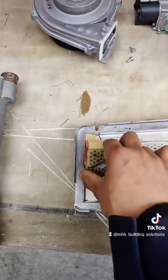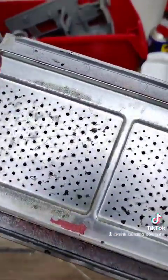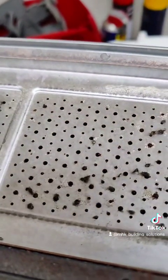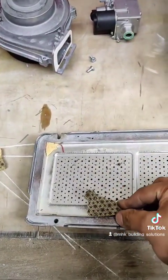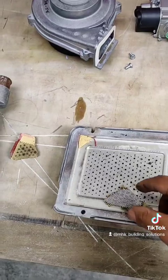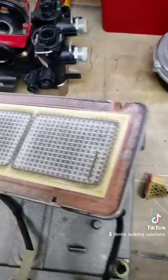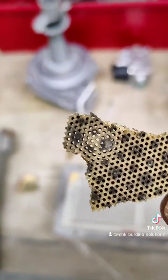This is the same burner that I removed the ceramic plate off previously for inspection reasons. As you can see, no matter how well you hoover it out, it still leaves quite a lot of this fluffy material stuck between the burner plate and the ceramic plate that's glued on top of it. This ceramic plate was this way around — I've only got a couple of pieces of it now. From this side it looks pretty clean, same as that side. But if you have a look from the other side you'll find that quite a few holes are actually blocked.